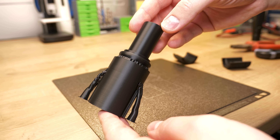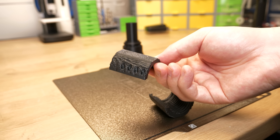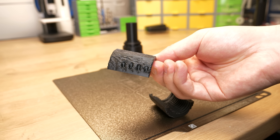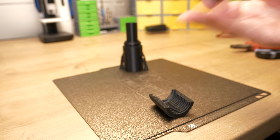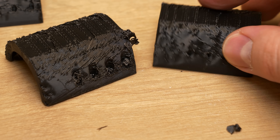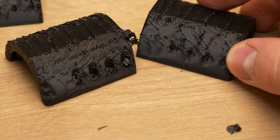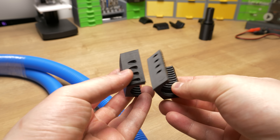Well, the connectors themselves turned out flawless, but the same I cannot say for those tube parts. This actually doesn't affect the usability of those models, but still it would be nice if they looked a little bit better. So I re-printed those with a different printing direction and using supports. Well, this didn't help. So I redesigned the outside of the model by removing those deep overhangs and now it's something to be happy with.